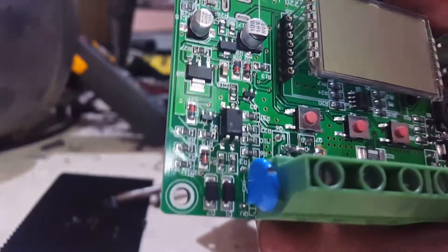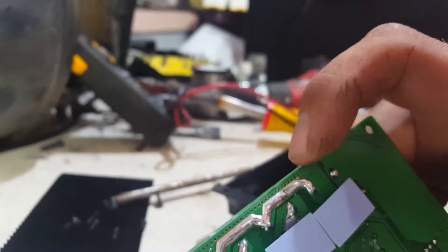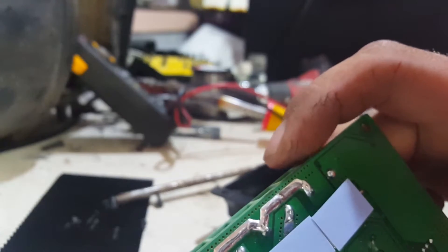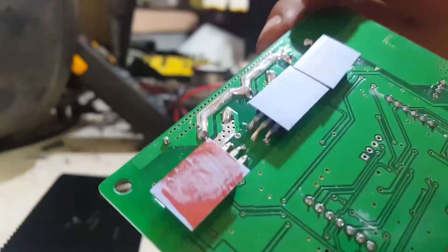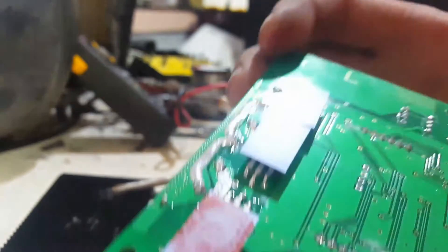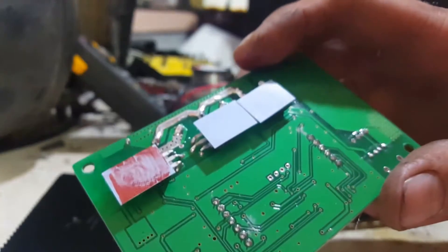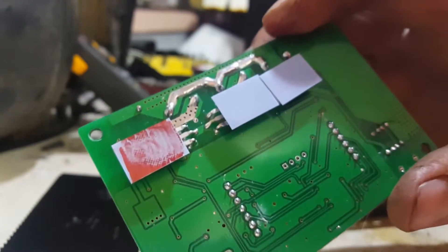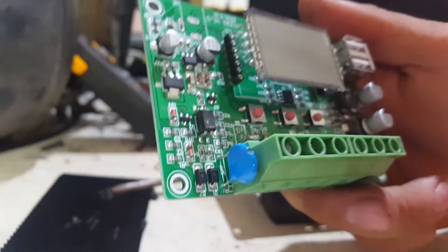Some joints are better, but those big blobs chilling in the no man's land there — there's a pretty big bridge made up out of solder on the back side here, and a lot of extra holes in the board. Obviously the board gets used for multiple purposes, but it's a bit odd. I can't understand why they put these thermal pads on rather than just using a nice big dollop of thermal paste onto that back casing, because that'll really dissipate the heat better. We can't read minds, I guess — the board itself seems alright.